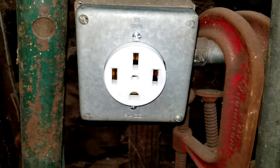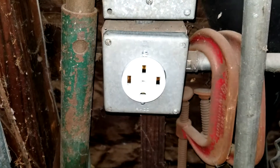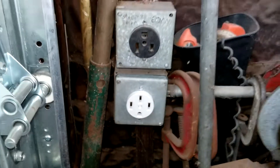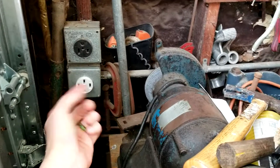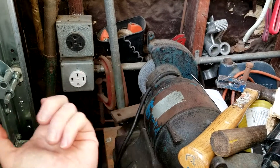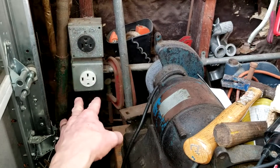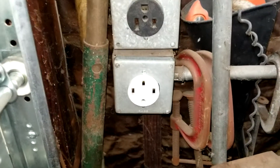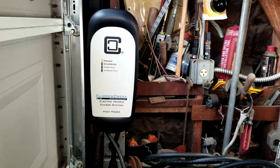I've used the provided screws for the 220 plug to screw it into my existing face plate — so we save some bucks right there. The ground is on the bottom right here so my cord will not get bent and messed up. Now we're going to go back to the breaker box, flip the 50 amp breaker, and test it to make sure we're hot again and everything is wired up correctly. Let's put juice back in the lines now that we're all screwed in with no exposed wire. Voltage meter says we are hot.